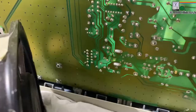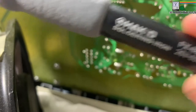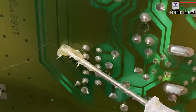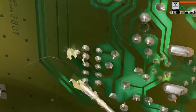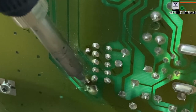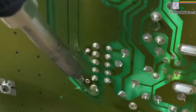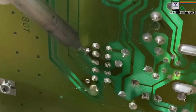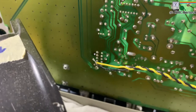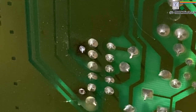Those are the pins I need to desolder. To desolder them, I'm going to be using my brand new Hakko soldering station that I got for Christmas — and I'm doing this in March. This flux just helps the solder melt and flow. Behind the scenes I'm pulling the wire out of these solder holes. Now I've got this wire out, and now I can use the wire whenever I need to. Now I'm going to clean up these pads.